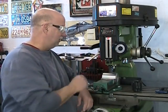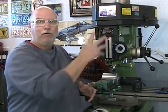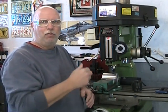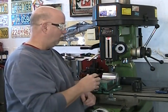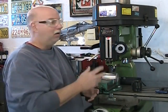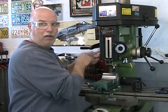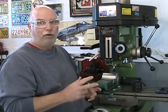As you can see, I have my milling cutter installed and I've lowered the head quite a bit. Now, why would I do that? You must remember that rigidity is important when milling. To maintain maximum rigidity, I want the quill to extend the least possible from the head of the machine. The higher up the quill is in the machine, once properly locked down, the more rigid the installation is going to be — and that's important for milling.